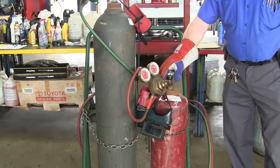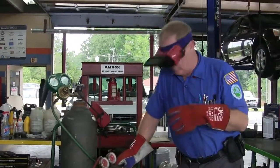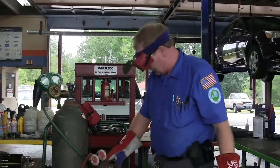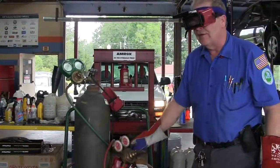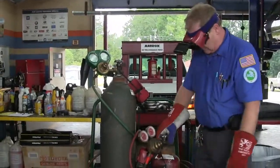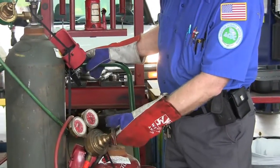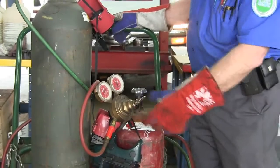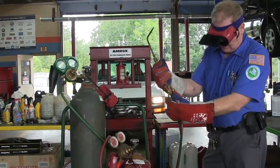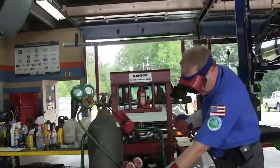I'm going to do a quarter-turn on the acetylene valve. The reason we do just a quarter-turn is so that if something falls on your hose and starts a fire, you can get your flammable gas turned off really quickly — you don't want to be frantically spinning a wheel. I've dialed in about 6 pounds of pressure on the acetylene. I've got my hose pressures set. You've got a red hose and a green hose. The fittings with notches have left-hand thread — on flammable gas connections both at the bottle and at the torch, it's left-hand thread everywhere.